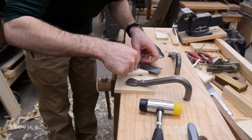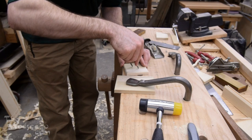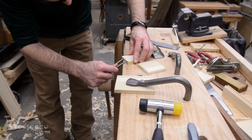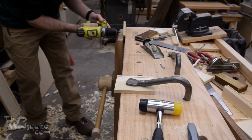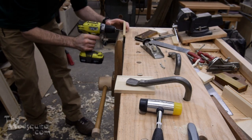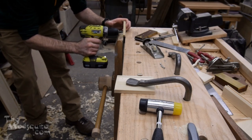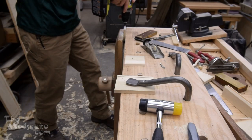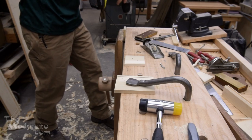And now I'm just marking diagonally somewhere in the middle — I have my divider set, make two little marks, and then I transfer those same two little marks to the center of that upright piece. And since I don't have my egg beater drill out here, just ignore that noisy, obnoxious, electron-killing thing. Drilled out the two holes in the base with the countersink and also drilled out the two holes in the upright.